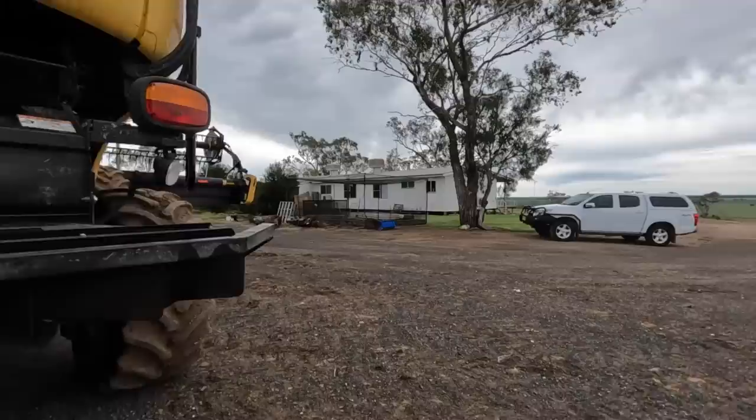So that was mostly successful. Let's see, that's very noisy. So this deflector plate here that we just put in, basically you can bring that forward and so it's here. So everything that comes around there goes down to the spreaders here. Everything that flies over here goes down through the chopper. That's pretty well where we're at there.